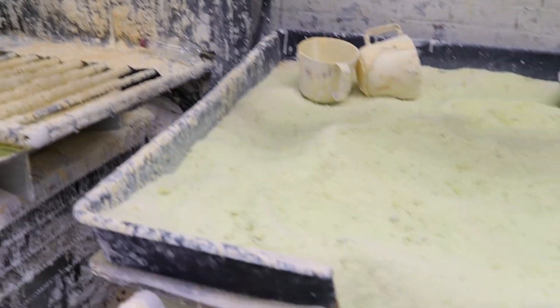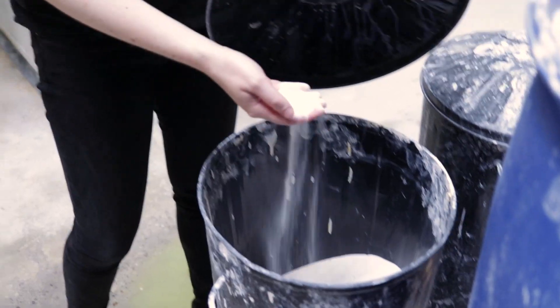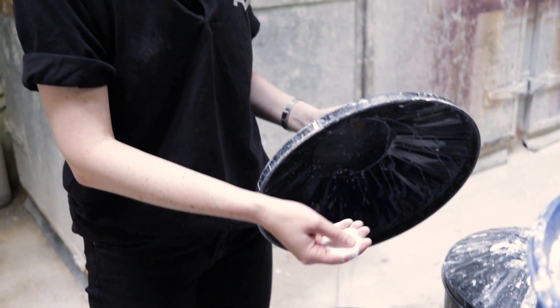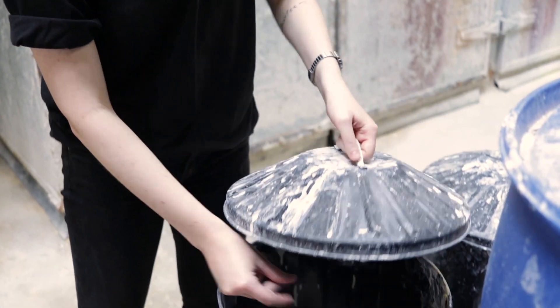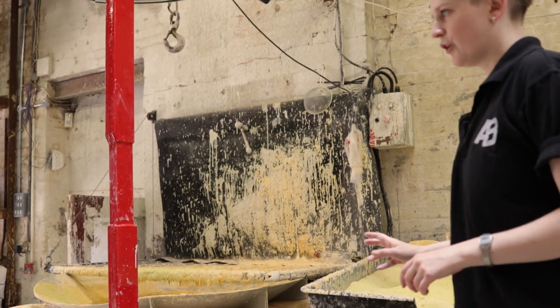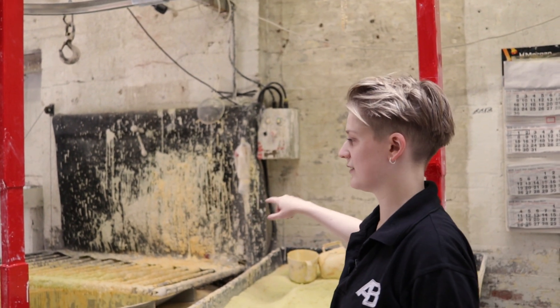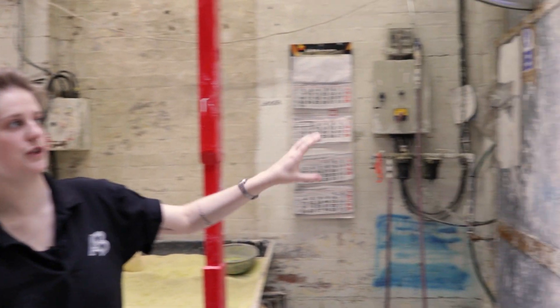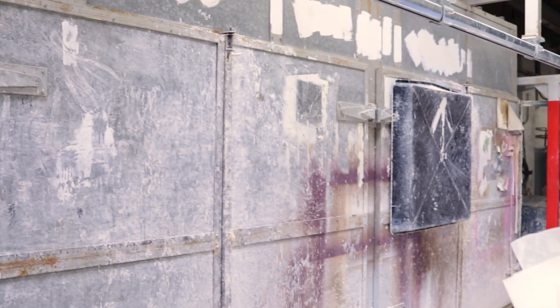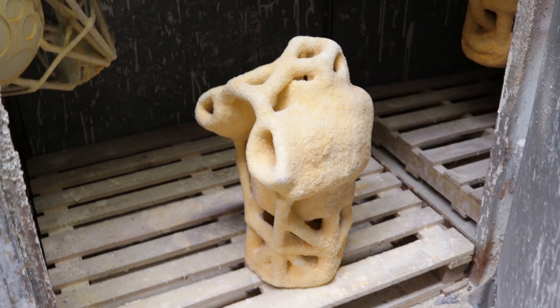The first step is applying the liquid ceramic, then the second step is a very fine version of this grit in these buckets. You have a really fine liquid followed by a really fine dusting of fused silica for the first couple of layers, and then you use what's in the tank and in these trays. This happens on repeat for about two weeks — every object comes downstairs, gets dunked in here, and goes into this giant airing cupboard to dry off and keep the wax cool whilst waiting for its next step.